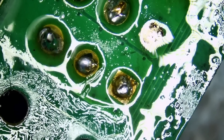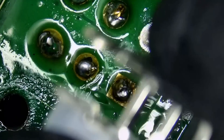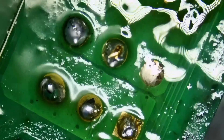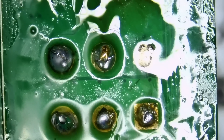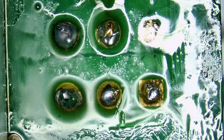Now we're going to apply low melt solder on those six broken pins. But first — how should the connector be oriented? If you look at the joints, the bottom is identifiable by that last pin on the right. Flipping the motherboard confirms the connector broke from the top, so it should sit on top. The pins are broken from the top. You have to use your brain — that piece of meat is a very nice tool if you know how to use it.